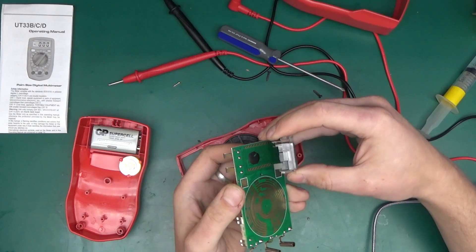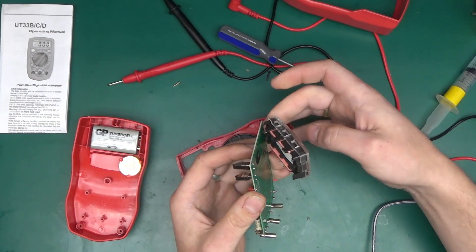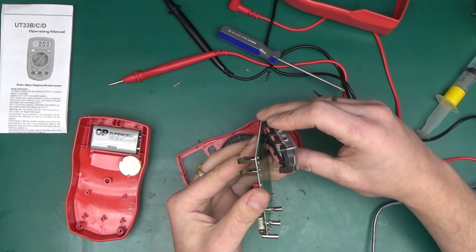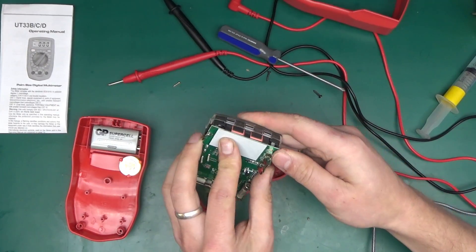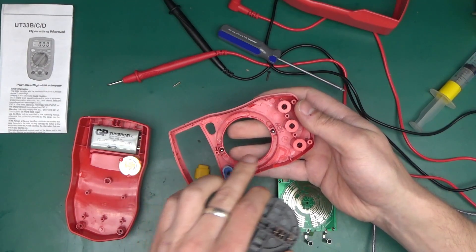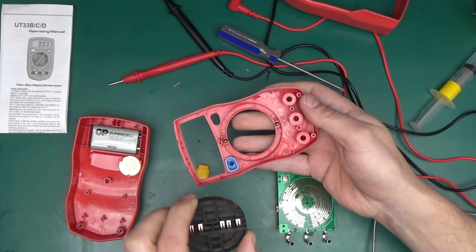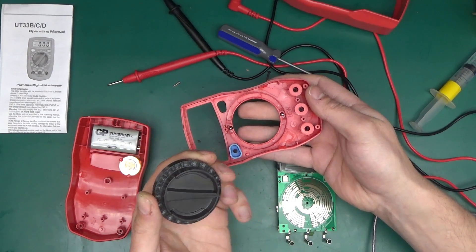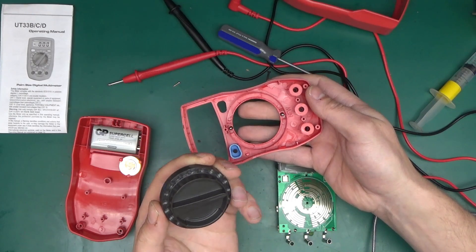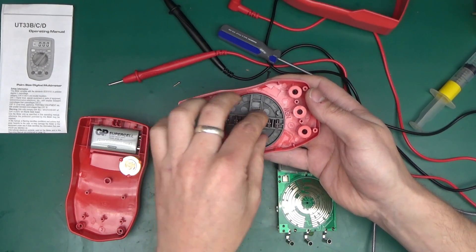Looking under the screen — it's a chip-on-board, so we can't go any further. There's a backlight LED on the side so I'm going to clip that back in before I need the soldering iron. Underneath you can see two ball bearings on a spring, and that's what gives the detents — two ball bearings causing very positive, decisive detents. That works really, really well on this simple multimeter.